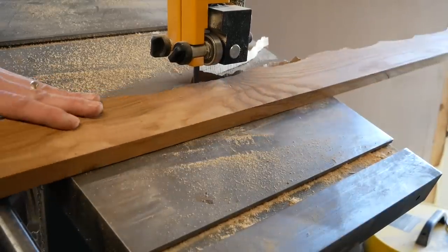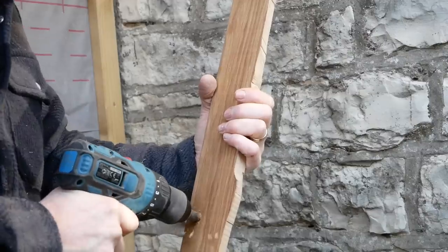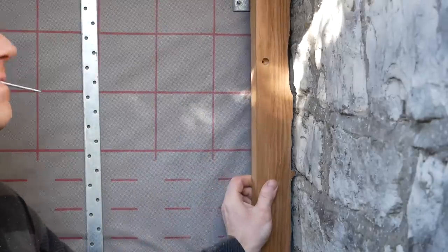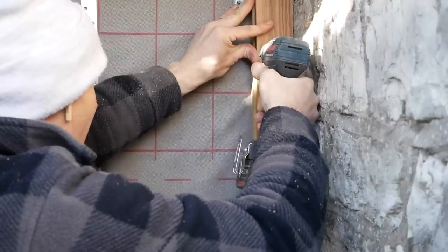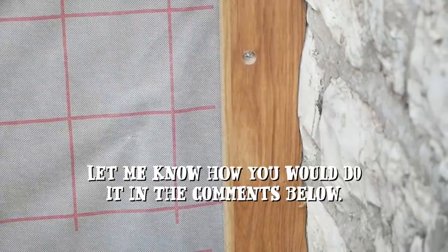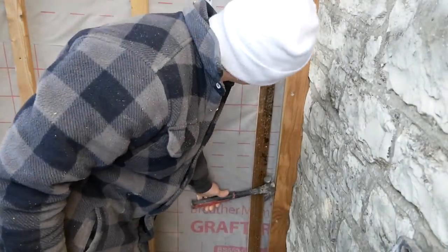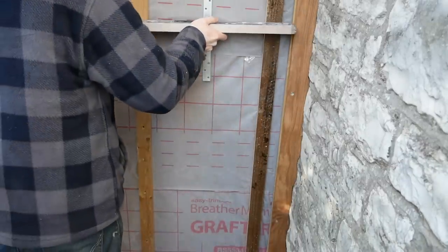Some would use a grinder or a coping saw to take away any bits fouling on the stone. I then drilled and plugged some holes so we'd be able to sand them smooth once everything was in place. This is a much better approach than spending time chasing out the stonework, which can't be undone in the future. It also means a much tidier fit than trying to point it up with mortar afterwards. Then I nailed in our last vertical batten, ready to install the cladding.